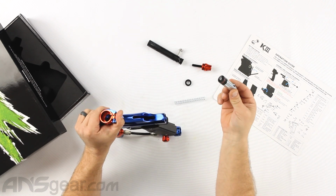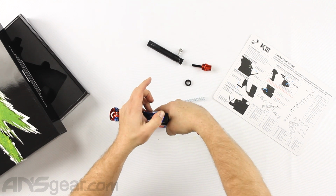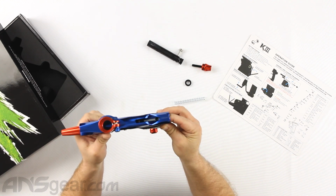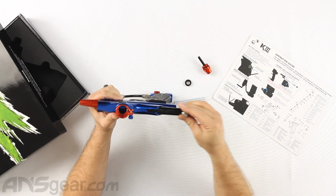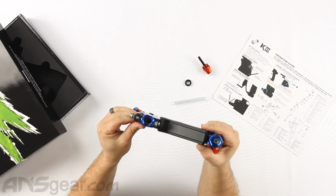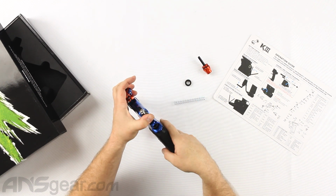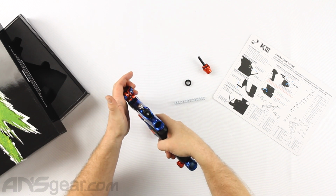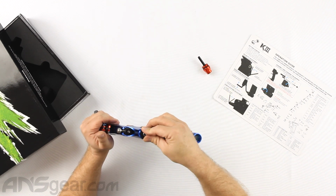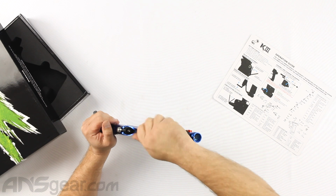We're going to take our hammer and we're going to put it in, and because our sear is sticking up and in the way right now, we're going to put pressure on it, and it's going to drop inside when we pull the trigger. Now, if we look at it, the hole is vertically up and down, which is right where we want it to be. We're going to take our bolt, lock it into the hammer, and look inside here, and we can see that it is physically locked together inside of there. Perfect. Now, once we know these two are one unit, put some more pressure on the back of the bolt, drop it all the way into the front, take our spring, put this on, or in the striker, take our bumper, put it around the spring, and then screw our back cap velocity guide in.